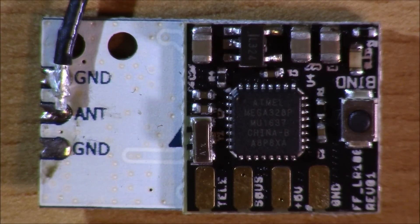It's incredibly compact, and the S-Bus compatibility requires no flight controller inverter. On their website there are instructions on how to set that up with your controller and in Cleanflight — you're going to need to turn off the S-Bus inverter. If you don't know what that means, just go to their website and they explain everything there. This is FrSky compatible, so any FrSky Taranis or other controllers — this will work with those, which is great. It's one of the most popular protocols out there right now.